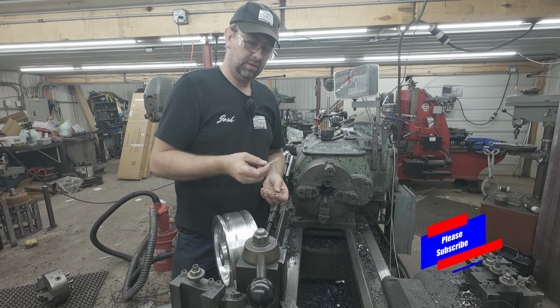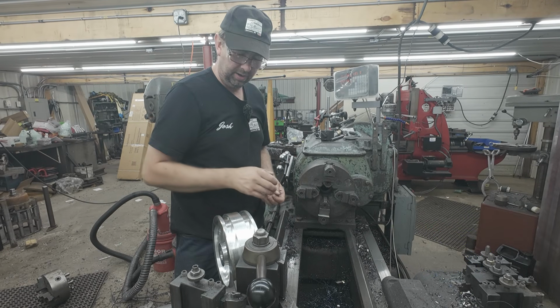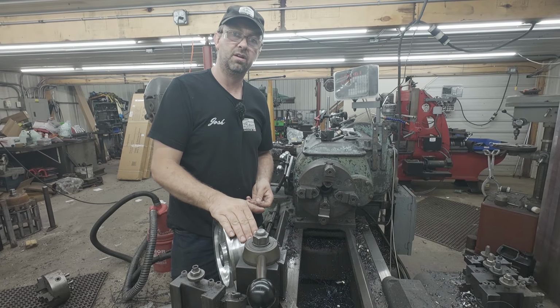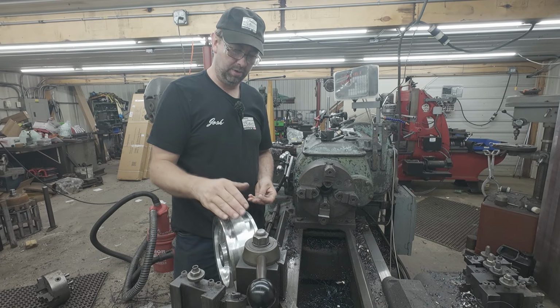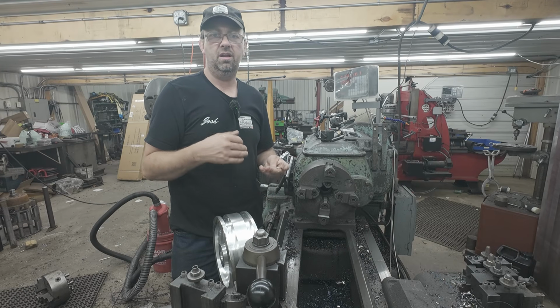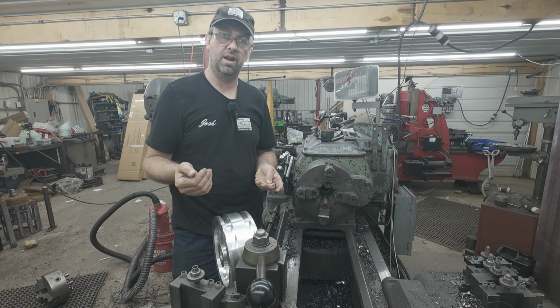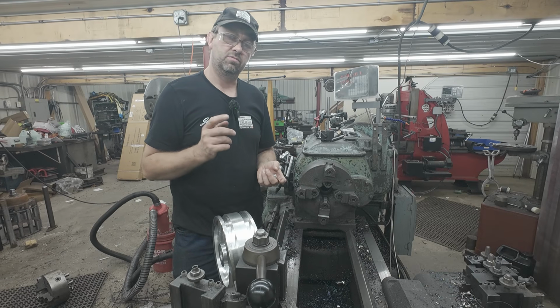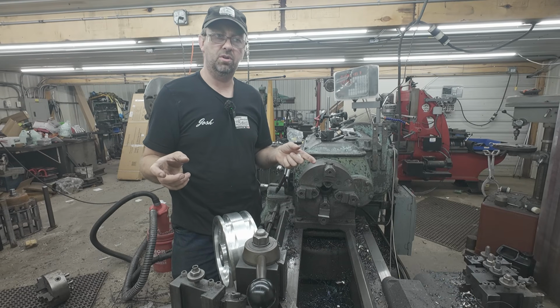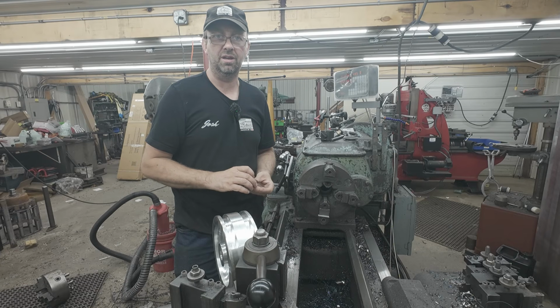And I've cut some shims. We're gonna put those on the jaws so as not to mark up our beautiful piston here. And we're gonna cut a 1 degree taper. And we'll just get that taper cut to size. And then next week's video, I guess we'll make the rod, the piston rod. That's a chromed rod. Taper cut on one end, threads on both ends. Pretty simple, straightforward job, but we'll do that next week.